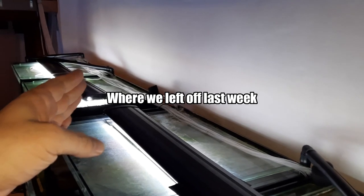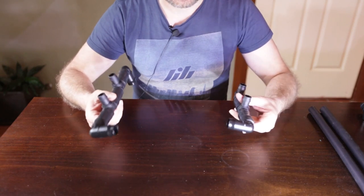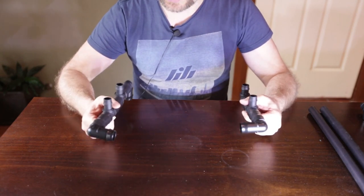Let's get into this week's video. At the top row of tanks, the left side has their plumbing going that way and the right side has its plumbing coming this way to the right. Hopefully now you can see how all the drain lines line up with each row as I go down to the bottom row. There's wiggle room — these can be moved around, not a problem if they're a centimeter or two off, and that's the great thing about these irrigation hoses.